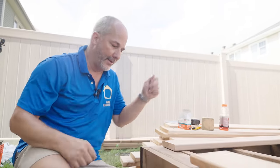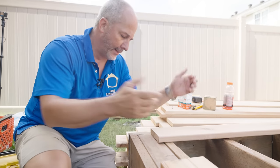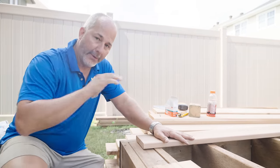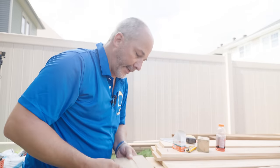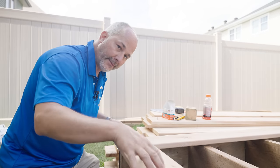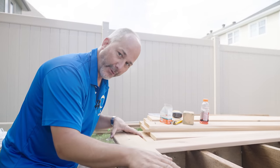So by adding a 2x4 and then another joist, we've now created this massive amount of meat. So what we're gonna do is always install your board to the middle of the 2x4, all right? And then when you're all said and done, you can come by with whatever piece you're gonna put on the edge. You can lay it over top of all of the wood to the right depth. You can pencil the line because this is gonna have its own character. It's gonna have its own movement. It's not gonna be perfectly straight. You can't chalk line and force the wood into position.